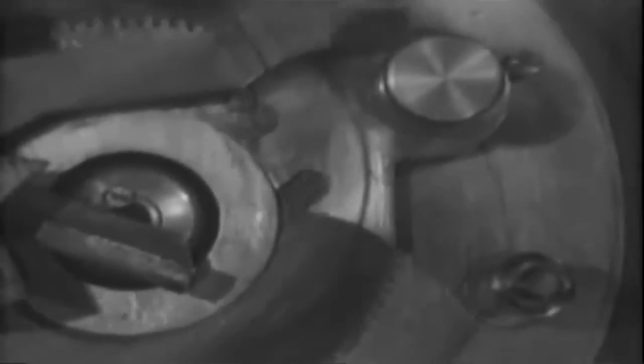After a preset delay up to 30 minutes, the stud on the timing gear moves the setting plate to free the release arm. The release arm frees the spring-loaded striker, which drives into the detonator.